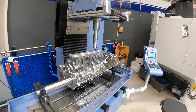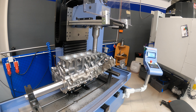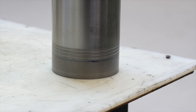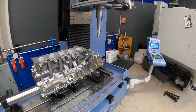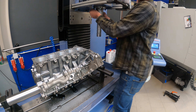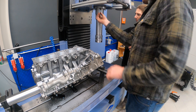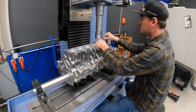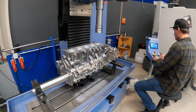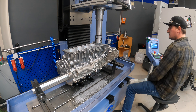I adjust the cutting tool again. My colleague checks it also and says it's fine. Now I set the correct drilling depth because the sleeve has a different diameter at the bottom than at the top. We do the same job again. Now I have to change the boring bar because this is the maximum diameter — I need a bigger one. I install the bigger boring bar and do the same job, as the top area of the sleeve needs a much bigger diameter.